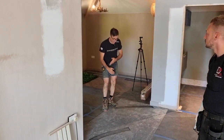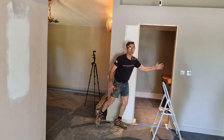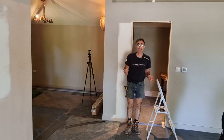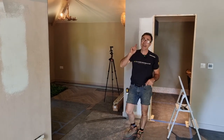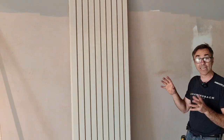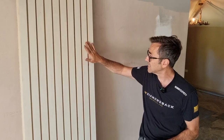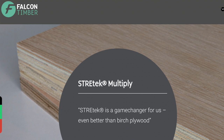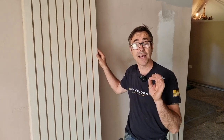It's going to incorporate two big mirrors, then travel into a screen and curve around to the dead centre of this hip rafter above my head. Beyond that, on a parallel radius, is another screen which goes back into this wall here and we'll go across this doorway as a hidden door. The door is the first thing we're going to clad — we're going to clad six millimetre Streetech ply on the door and the surrounding areas of wall that have the slats.